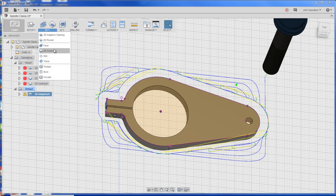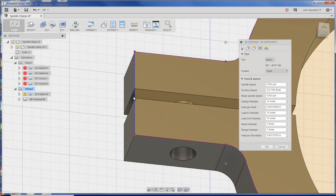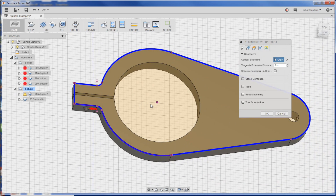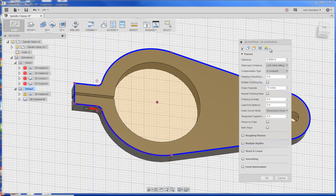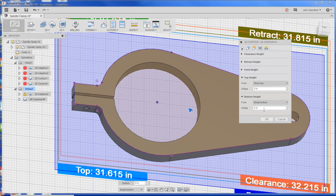Then 2D contour - tool 31 as a cleanup tool. Choose that line, watch the red arrow - that is on the wrong side. Flip it and that should do it all correctly. We can do this in one depth cut, but we may have to choose the heights. Bottom height: model bottom, go down negative 0.01 - a tenth past the bottom. That's how we create our CAM toolpaths. Want to see us machine it? What tool are we going to put in this thing? The mystery tool - stay tuned for the Wednesday widget next week, folks. Take care, see you soon.